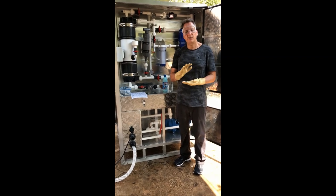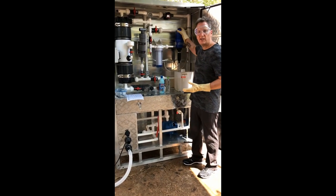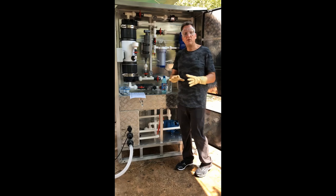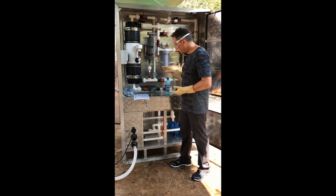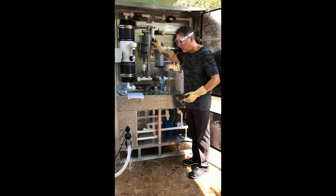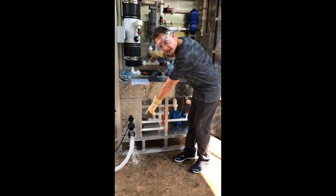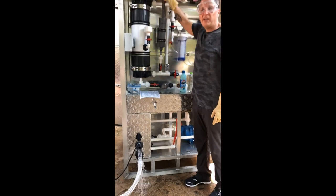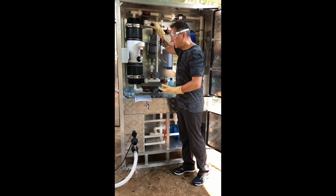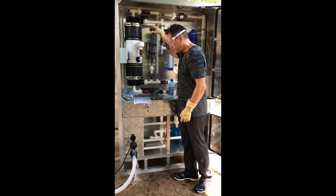This is Video H about how to clean the Aquapod using its daily cleaning procedure. Right now we're in water production mode — you can hear the Dosatron clicking and clean water is being produced. To begin the cleaning process, we open valve 1, make sure valves 2 and 3 are closed, then open valve 7. Water comes out the back flush. We then use the air pump, pushing it 25 times. This air pump purges air into the UF filter body, which disrupts contaminants and allows them to be flushed out of the filter.